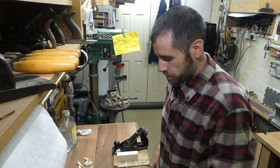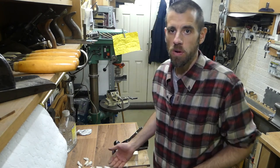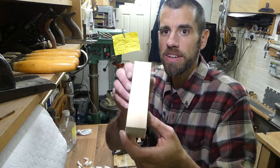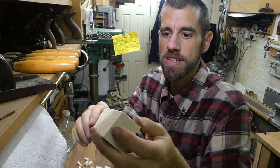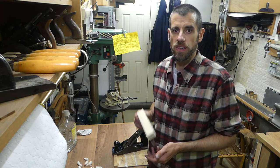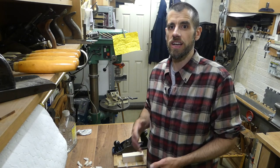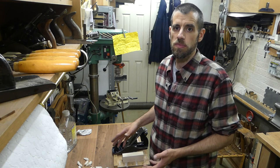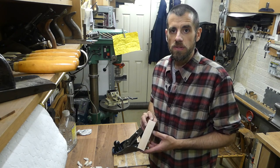That's what I was hoping to achieve, and you can see it didn't take long to put that edge on the plane. It wasn't beyond serviceable as it was — it was still cutting — but there were some very fine little nicks and scratches in the edge showing up in the timber. You can see just how clean and smooth that surface is — smoother than you'd ever get it sanding. Wet and dry paper is perfect for this job — cheap, and the float glass is perhaps a little more expensive but certainly cheaper than a whole set of Japanese water stones which need constant re-flattening for plane blades. So this is a fairly quick, simple, cheap solution to achieve the edge we're all looking for. Thanks very much for watching, I'll see you again soon.